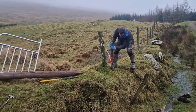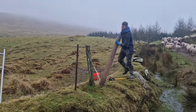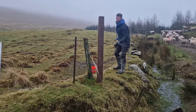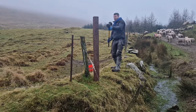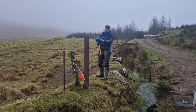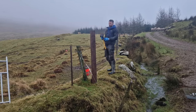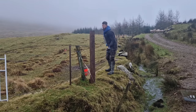The ground seems to be soft enough here now. A gravelly lump. Right, we're throwing this here now, hopefully. We have a big enough hole, hard enough poles to drive now with a sledge. These sledges, these hammers, the one with the round head, you can get rubber ones as well. They're the best because they don't split the poles at all. The small square ones, they split the poles. Very bad. We've this one good for years and it hasn't split one pole yet.